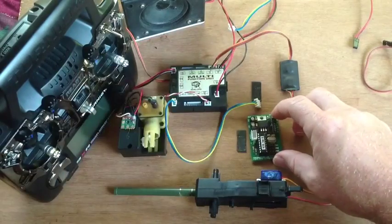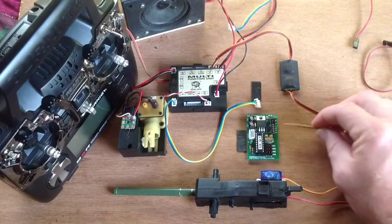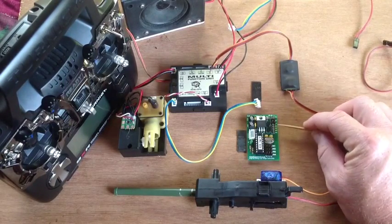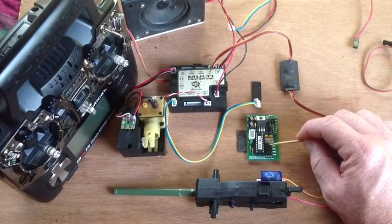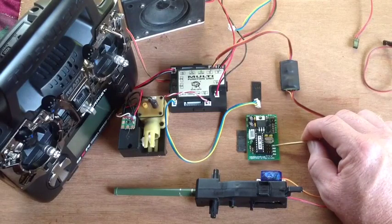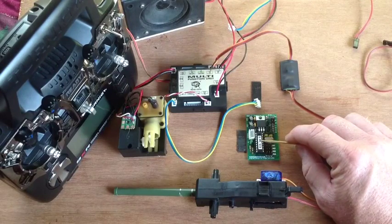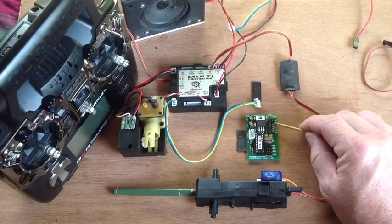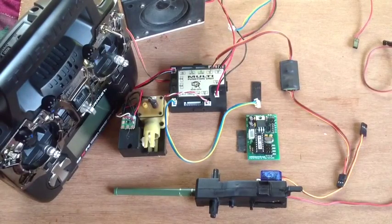Let's have a look at the RC2HL board first up. A few new additions to the design. First up here you'll see an output port: A1, A2, A3, A4. That is simply a repeat of the receiver signals, so whatever is sent in on channel 1 is split — the channel 1 signal goes to the onboard microcontroller and is then sent back up here to A1. This port is for connecting to any additional sound module boards, so you can just use those outputs to connect to any of the other available sound module boards.